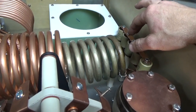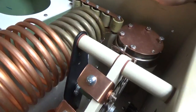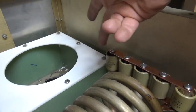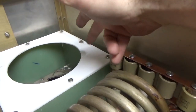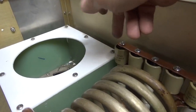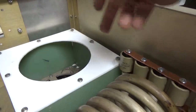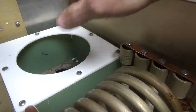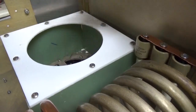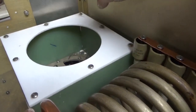Then I'll work on the protection board and go on from there. This strap will go from here to the side of the tube — similar to what I did on the 6 meter amplifier, I'll add a strap with a hose clamp going right from here to here, nice and short. I don't believe in going to the center, because then you add a lot more lead length and that strap gets heated up by the exhaust — the hot air coming out of the radiator from the anode.